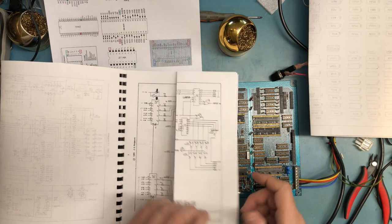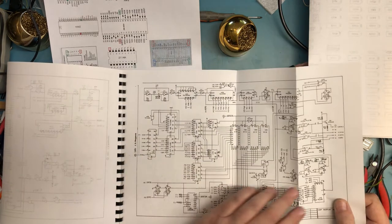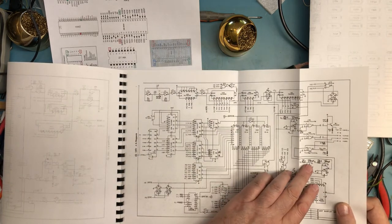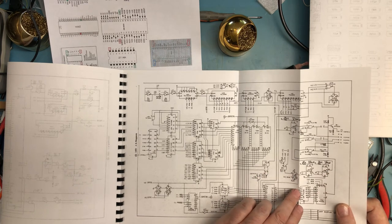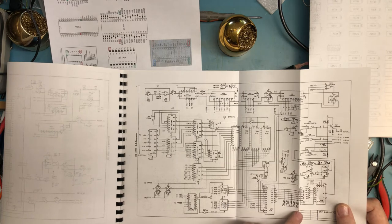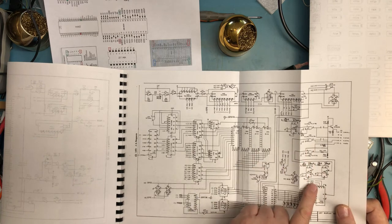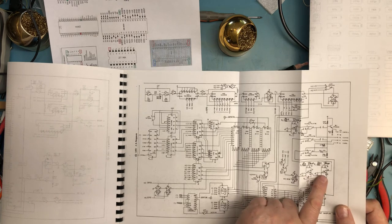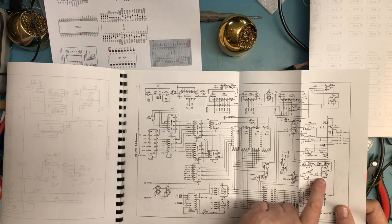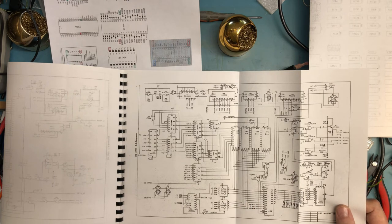So I'll chain up a couple of one shots there. Go back and look at those again. 450 picofarad, 180 picofarad. 68K pull-up, 39K pull-up. So those are generating video timing stuff, it looks like, again. They're 123s, so they're one shots, acting as kind of a delay line or something, maybe.